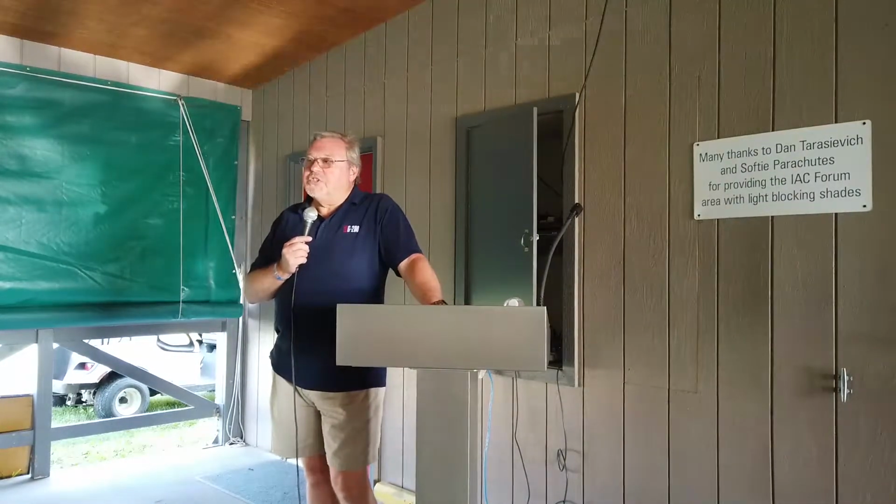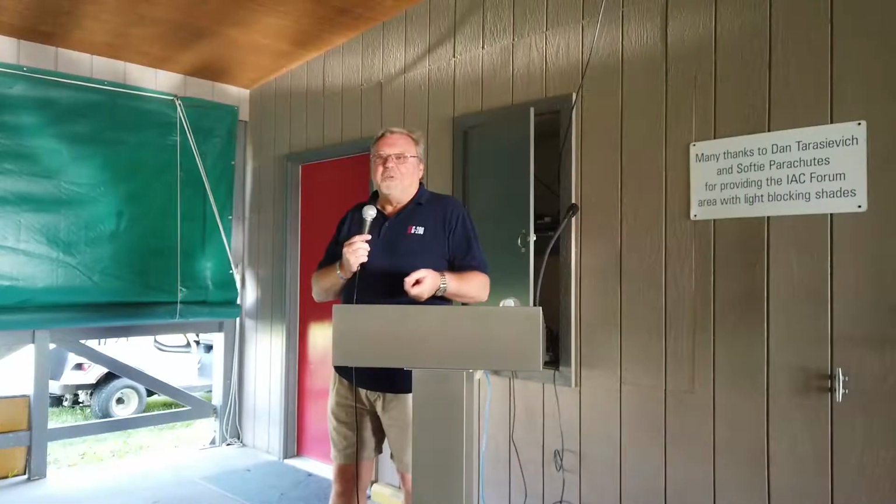I was here at Oshkosh in the World Contest, and I saw this airplane from France, the Cap 21, and it had the first of the blunt nose slab-sided airfoils that are common on all of our aerobatic airplanes today. It was the first time we had seen those. The laser had a 23012 airfoil, and the Pitts has symmetrical airfoils, but not that same blunt nose slab-sided airfoil. I wondered, what the heck is that airfoil? It looks so silly. We even called them ice cream cone or snow cone airfoils.